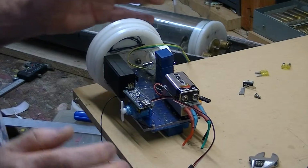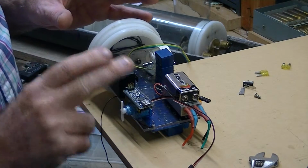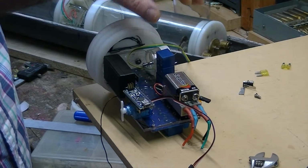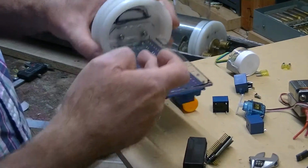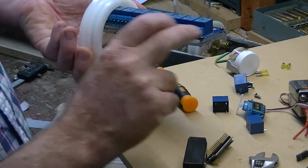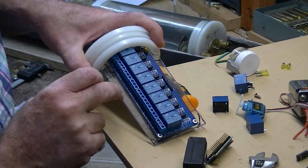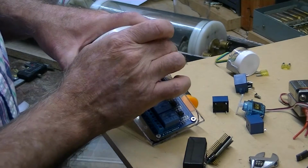Alright, now one other thing I've decided is to reconfigure this, because I'll have the low voltage side on this side where the Arduino is, and the high voltage stuff on this side, which has the main power, has the battery, has the input relays. One of the reasons for that is that underneath here the wires from the Arduino then can control these wires on this side, and this is the bank of high power wires that are going to go from here to the motors. So I'll keep all one on one side and keep everything on this side, which means I'm also going to put on this side and on this side some plugs which are going to be high voltage, low voltage.